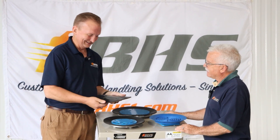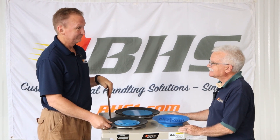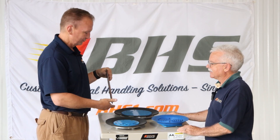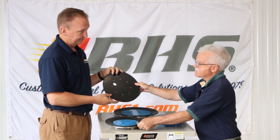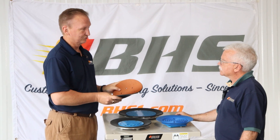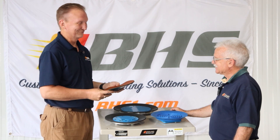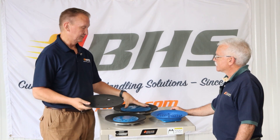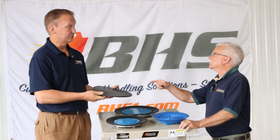The surprise piece is that if you have operators who, even after multiple training sessions, are still doing damage to vacuum cups, we do have a heavy-duty rubber piece available. It's got a nylon backing, it's a little stiffer, and a lot less likely to be torn — more resilient to operators that don't follow the instructions. The heavy-duty cups are available as the complete assembly or as a replacement pad, and regardless of which cup you originally bought, you can change over to the replacement. It fits right in with standard hole sizes.